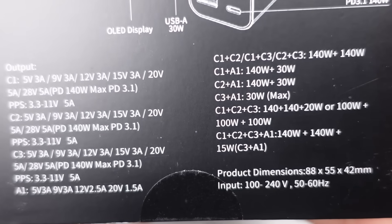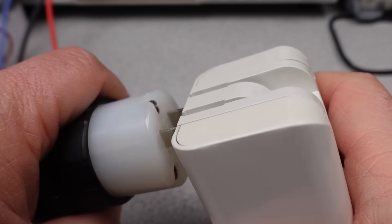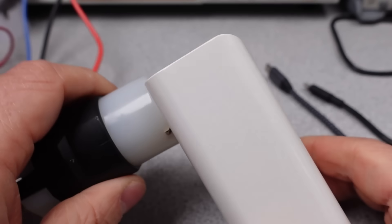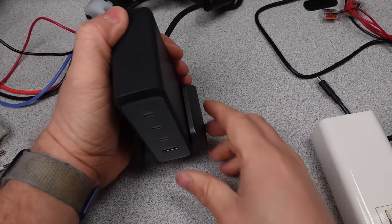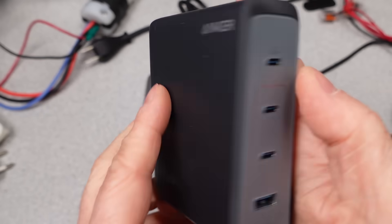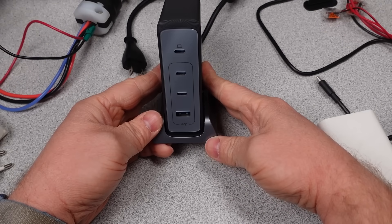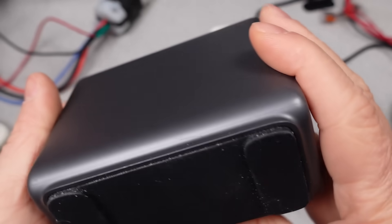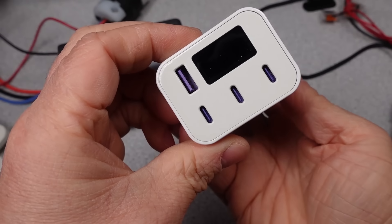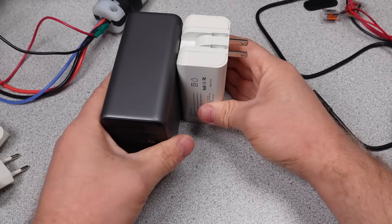It overheats badly. The 60-degree C operating claim is bogus hogwash. It has the least safe AC clip-on adapters I've seen — they leave exposed AC mains in so many situations. You can plug them in and literally hold on to the AC pins' direct connection. An RCD won't protect you when you have both pins. This can easily kill someone with no protection to stop you. I'm going to stick with my Anker 240-watt adapter — it has better efficiency, lower idle power usage, and can hold up to its rated watts. It also showed up on the first page of Amazon when searching for 300-watt adapters, so it should be in anyone's consideration. There's a full review on the channel. Thanks for watching — links in the description, but not to this thing. Goodbye.